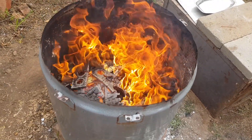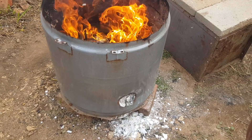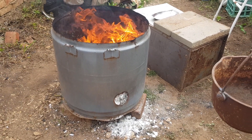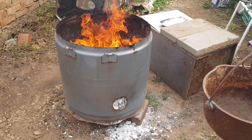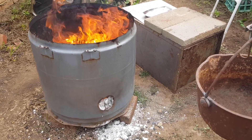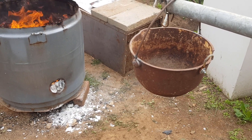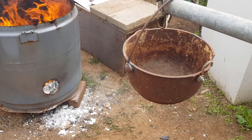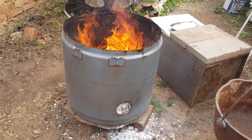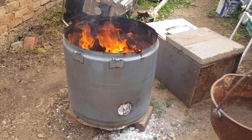We're having an experiment today. I've lit the fire and I'm just building up a bit of a coal base — you can see that center section has already got a bit of draft coming up through it, so we should get plenty of heat. I've seen lots of furnaces on YouTube where guys melt aluminium using fan-forced methods like an old blower or a reversed vacuum. That does generate more heat but also burns out your crucible faster. I don't need excessive heat and I don't want to use power, so hopefully this natural draft method will give enough heat. We'll build up a coal base and then lower the pot in for a test run.